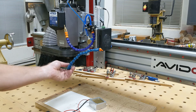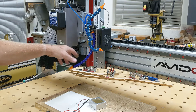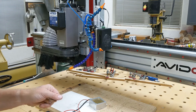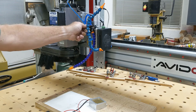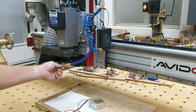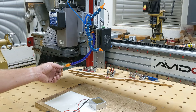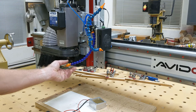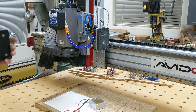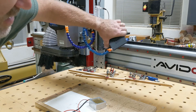So I put that on and now I've got high airflow for cutting wood and things like that where I just want to blow chips so the vacuum can take them out. I also use my mist system when cutting metal — when cutting aluminum I use isopropyl alcohol; it's got a little venturi that sucks it out of the container with adjustable air pressure and flow. This mist nozzle doesn't work well for just simple chip blowing because it's designed with a passage to carry fluid, so the airflow is weaker. That's why I have two systems, but they're mutually exclusive with the laser, so combining them keeps things tidy.